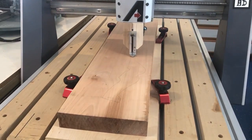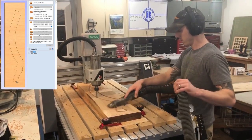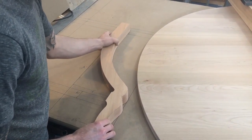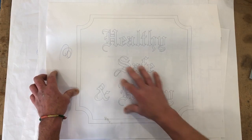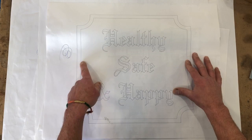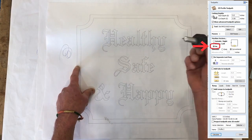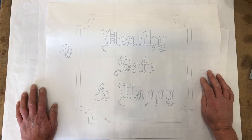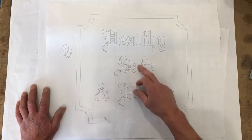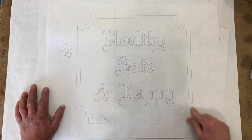Here's a good example of previewing a part by drawing. This is two-inch thick solid cherry — my son needed to make four legs for a table he's building. We drew it out, then followed up by cutting it. To set this up in V-Carve, it's basically the same — all the same vectors. All you do is select the items you want to draw and use a profile cut centered on the line, not inside or outside, but centered on. The pen tip is so small it's negligible. I enter in usually a 1/16-inch diameter end mill just the way I run a preview. It will follow the center line of all your vectors and draw you this.